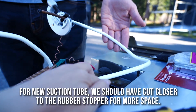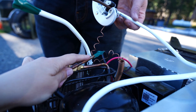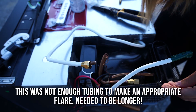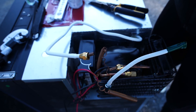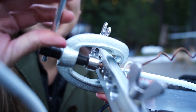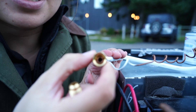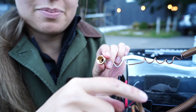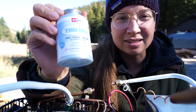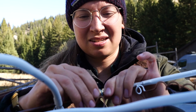The next step is to take our suction tube from inside the fridge and join it with the piece of suction tube we cut off yesterday using two flare nuts and a flare union. Important: put the flare nuts onto the tubing before you make the flare — if they're not on first you will not be able to put them on afterward. We just made our first flare fitting. This nut has to go on first since it gets stuck at where we flared out the metal. We'll do the same on the other side, then use this flare union with some pipe thread sealant — which I confirmed is safe for refrigeration — around the male threads, and then wrench everything together.